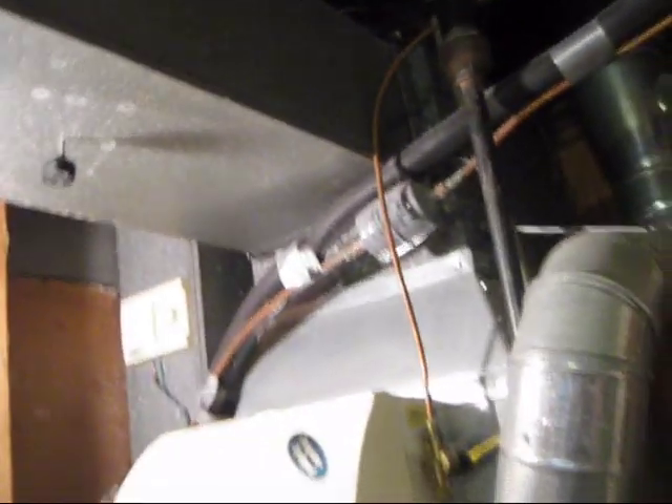And this is the supply. It's not located right above the heat exchanger where I know most people put them, and I know that could throw the reading off a little bit. But instead it's right on the supply that goes off to those vents and the rest of the house. There's also another supply going that way, but it doesn't matter — all we need is test one here. I just drilled two holes and this one fits really snug in there, it's not falling out or anything.